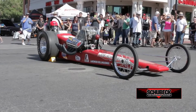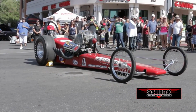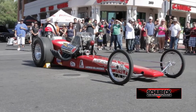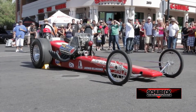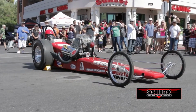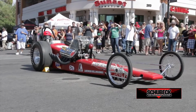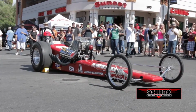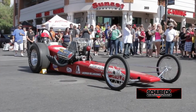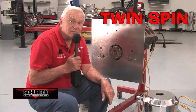Important to note here is that the electricity for all operations is only available when contact is made by a sensor when the car is in neutral. In other words, no electricity flows unless the drive line is disconnected. There you have it, an electric starter for clearing old nitro from the cylinders and a one-man controlled fuel and starter system.